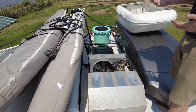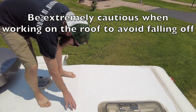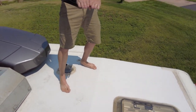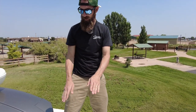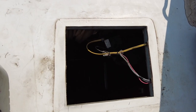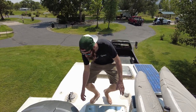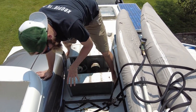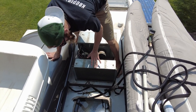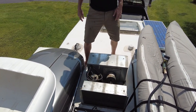The next thing we're going to do is take the air conditioner off and move it right here. If you notice on my roof there's a line here — that's where the slope changes direction. We're going to be hosing this thing off, so we don't want that water to drain back into the hole in the roof. We want the water to drain off over here. When you do this, be careful of the sharp corners — don't damage your roof. Set it down flat, and don't drag it on the rubber membrane because it will rip.